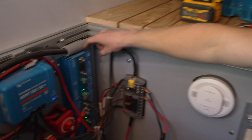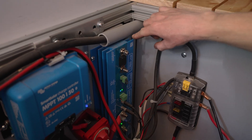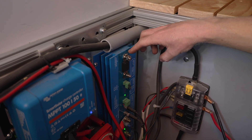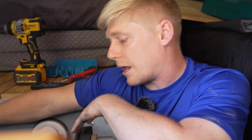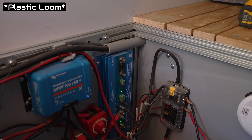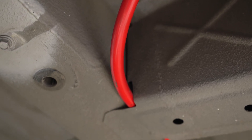As we dig in, here's what we're going to start fixing. First off, this is a Smart BMS 12-200, which has an alternator charging connection. It's similar to a DC-DC charger but not quite the same — it's somewhere between a DC-DC charger and a battery combiner. We're going to land our alternator wires on the top of the BMS. The gauge they used was acceptable, but the wire was run without any mesh loom so it was unprotected, and the positive wire was chafing against some sharp metal corners underneath the vehicle. We're going to run new wiring — a positive from the BMS and a negative from the Lynx distributor — all the way under the vehicle with plastic loom, well secured to the underside, all the way to the starter battery. The next thing you'll notice is there are several connections in here that are not well made.